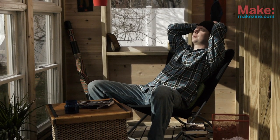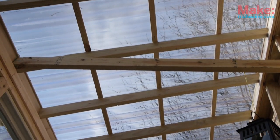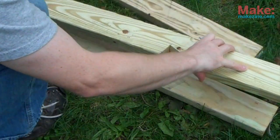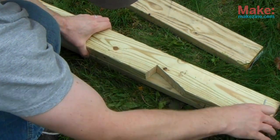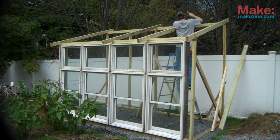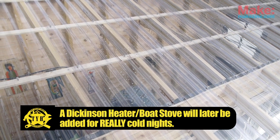Casper the Friendly Host here working on my tan. As for the rafters here, they actually are 2x4s because they span such a short distance — about six feet or a little bit under that. In this case, they're attached via a bird's mouth cut. There are a bunch of methods as to how to cut those. The tip is, once you get one of them done right, assuming your walls are all plumb, straight, and even, just use it as a template, trace it onto the others, cut them, and go down the line nailing them in place. It's really easy. And the sealant here is silicone — caulk up every single gap you can find so as to make this more airtight and retain all the heat.